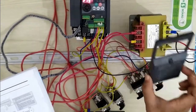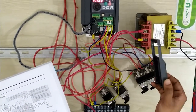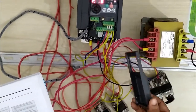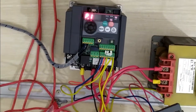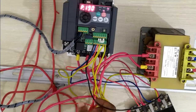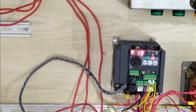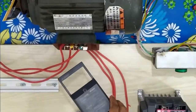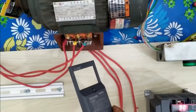The supply voltage here is 380 volts. We are using a 220 to 380 volt step-up transformer, which is directly connected to L1 and L3. That means one phase is missing — L2 is missing. The output terminals UVW are directly connected to our motor's three-phase input — U1, V1, and W1 — with the outer terminals shorted by star connection.